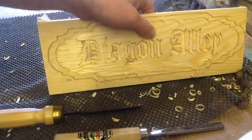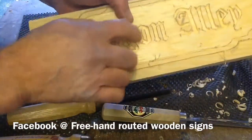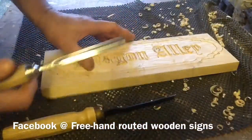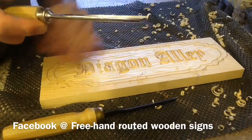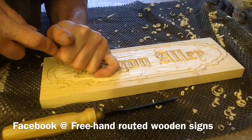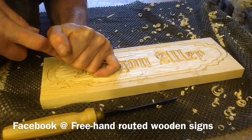You're getting the idea of that, so I'm going to go ahead and finish that up. Pretty much done, just have to kind of do this in around the letters — and for that part you just need to be so careful. Make sure you have your sharpest chisel on hand, and if it gets dull, definitely don't try to continue or you will just pop these letters out.